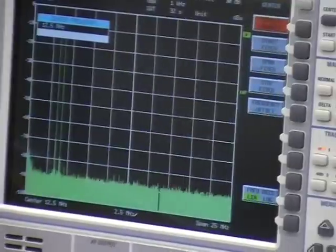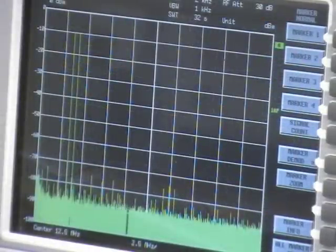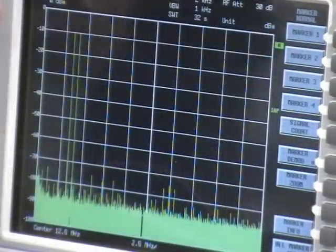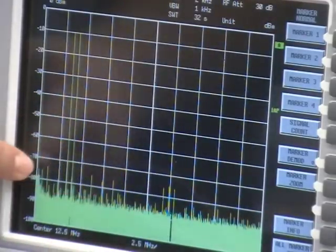Through LabVIEW, the digital pattern generator is programmed. The DAC test chip converts the digital pattern into an analog signal. However, if we investigate the frequency components of the DAC output, we will see not only the two main D2A converted signals, but also a lot of harmonic distortion spurs.